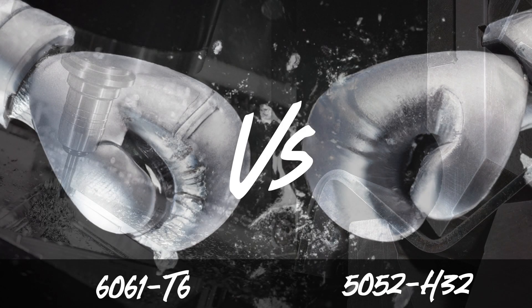If you're accustomed to selecting 6061 T6 aluminum for machining, you may find yourself automatically requesting that same material for your sheet metal parts. But 6061 aluminum isn't typically the best choice for sheet metal. For aluminum fabrication, we usually recommend 5052 H32 instead. While both aluminum alloys are lightweight, strong, corrosion resistant, and weldable with some potential for heat deformation, the two materials are not interchangeable.